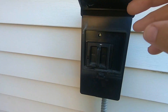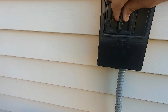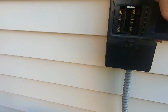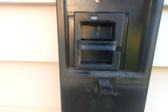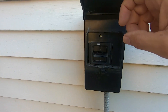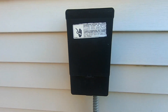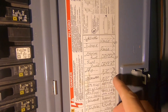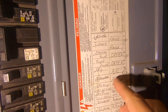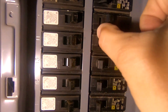This is the outside disconnect. When you pop it out, you can read the words on it. We flip it 90 degrees and it says off — that's how we know our particular unit is off. If you want to be sure it's off, go to the fuse panel. Here you can see numbers 10 and 12 are AC, so you can throw those breakers to the off position to disconnect from outside.